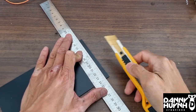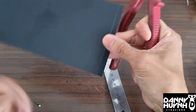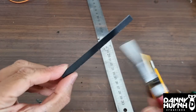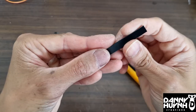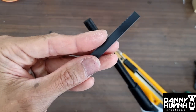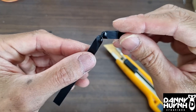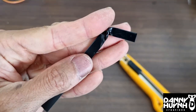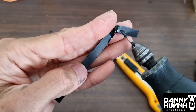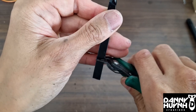To make the link I'm going to use Styrene. The best thing with Styrene is you can cut it and then just snap it. With this piece we're going to make a link. I need a curved link, not a straight link. Heat it up and you can change the angles just by doing that. I need something like that shape. Now drill holes — probably two, one here, one here, depending how much throw you want. Cut it up, round the edges. Here's what it looks like mounted.